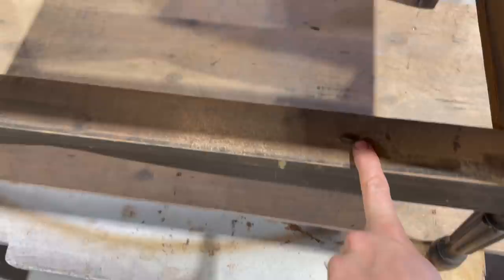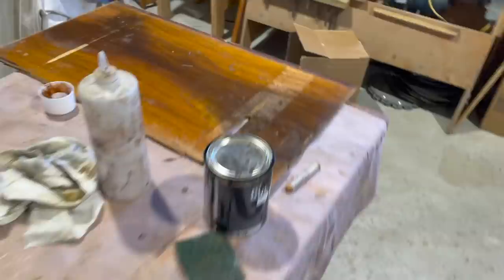When your drawer wears out, it gets lower and lower and lower riding on the sides here. Once it gets low enough, when these start contacting, this just starts scooping out wood on the bottom of the drawer. And soon you have pretty deep grooves, and in this drawer's case, holes. So we're gonna replace this.